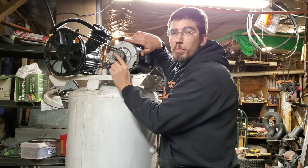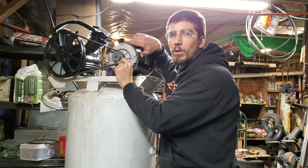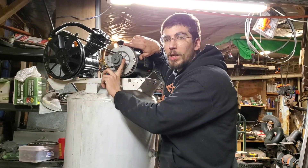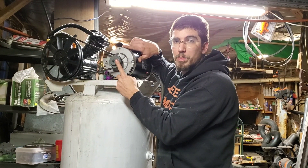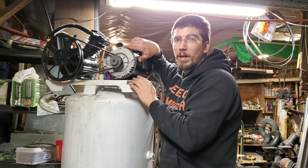I ended up having to purchase this pulley. Make sure you get a cast iron pulley. Over time, the aluminum ones and the zinc ones will end up failing and doing damage. Buy cast iron — spend the extra money. I'll post a link in the description for anything I talk about here.